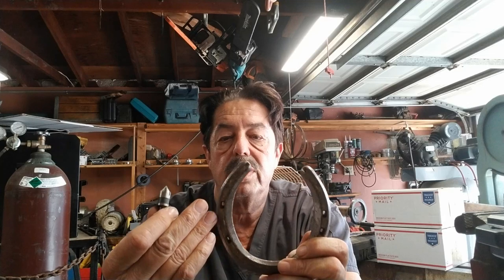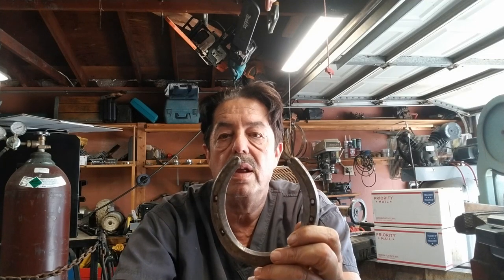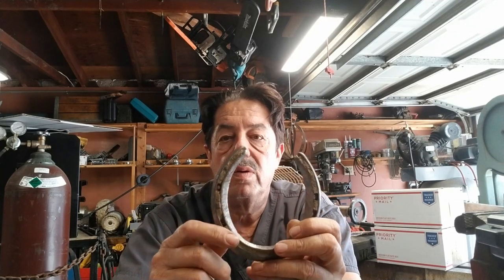Some of the things you can do — I'm just going to talk very briefly and it's only going to take a few minutes. You have a horseshoe. If I drill a hole here and a hole here, I can use a countersink bit. After I drill that hole, I can use this and drill a little chamfer on each one of those holes so that when people put screws, they'll sit flush or just below the surface. It looks cleaner.